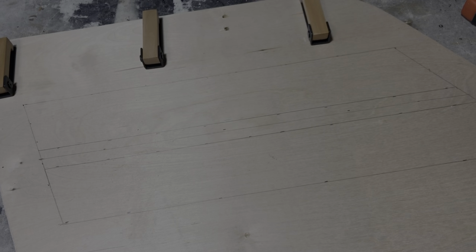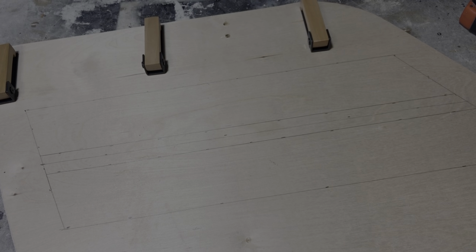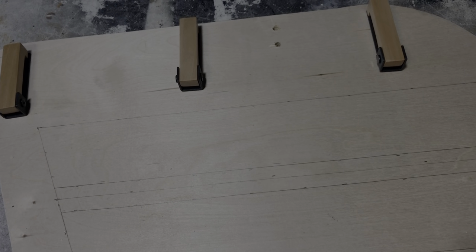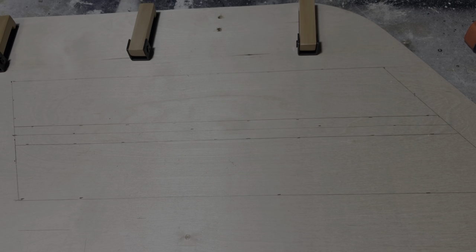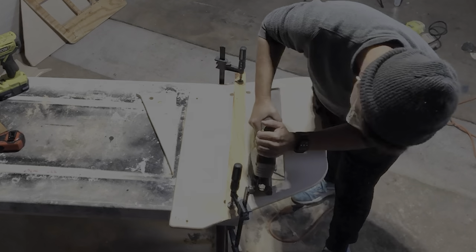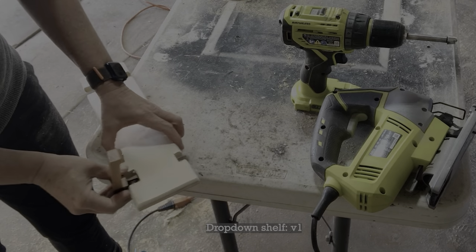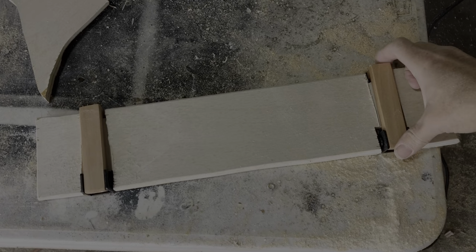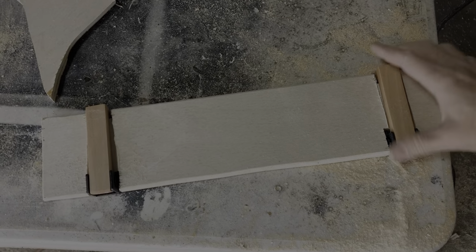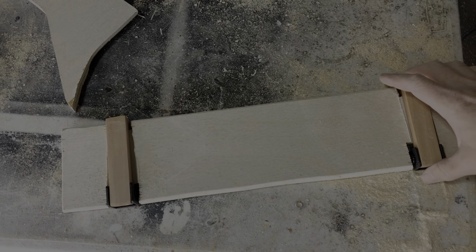Sweet. All right, so the space available in the middle is 6 3/4 divided in half, 3 3/8. And then I put a half inch on either side, so we have an inch long bar in the center. That is the plan. Took a couple passes, but there we have it. Ugly as sin, but thankfully I have plans to address that.